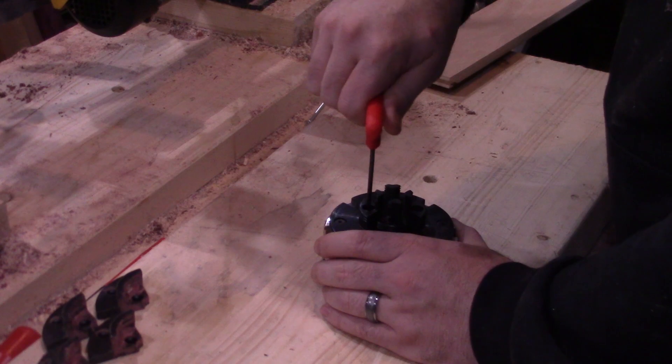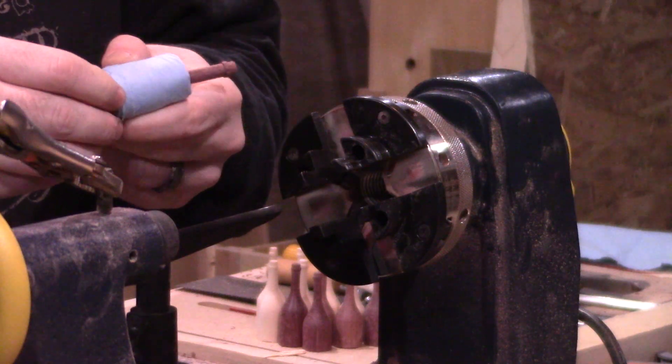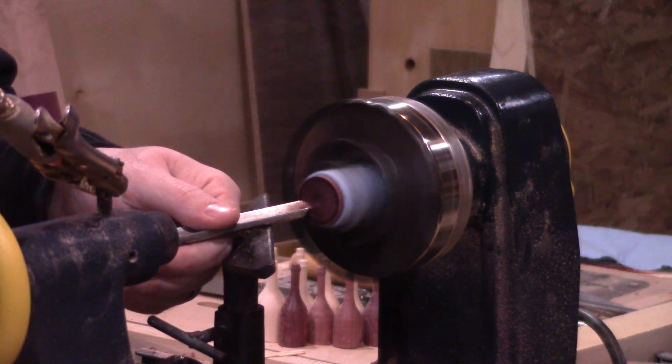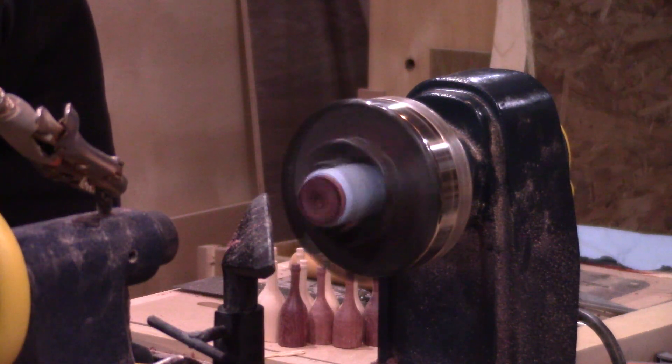More, not less. Some of the bottles didn't come through perfectly flat when I cut them free with the handsaw. Last time I just took them to the belt sander and tried to level them up that way, but I wasn't too happy with how that worked out. So this time I tried the four jaw chuck — I swapped out the jaws for the spindle jaws, wrapped the bottle in a shop towel to prevent marring the surface, and turned off the bottom of the bottle with the parting tool. A couple of the bottles had some funny catches and got damaged by the jaws or the lathe tool, so I had to remake a couple. This time I made them longer and cut them off with the parting tool right from the blank, and that worked out a lot better. You'd think I would have recorded that, but no.